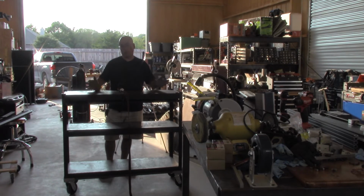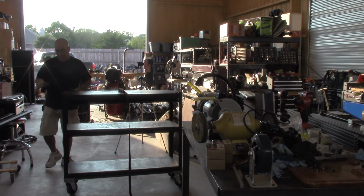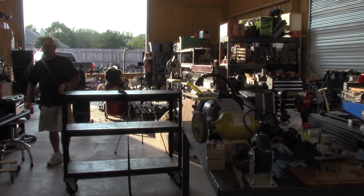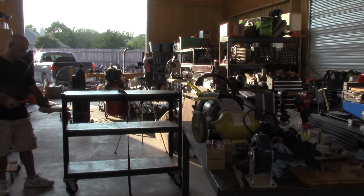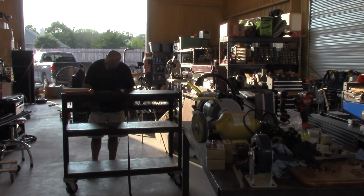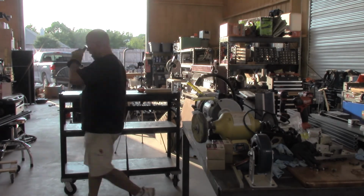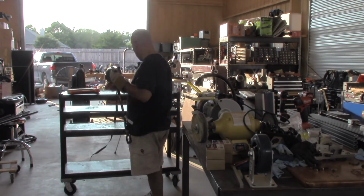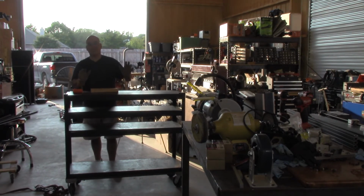This could have also been done with 2 or 3 helpers holding the board while you position the struts. You're not gonna get a lot of space to hammer the struts in place, so just get a piece of spare wood and hammer into position. Now release the ratchet. Repeat the process with the other shelf and you will end up with a 5-shelf system.